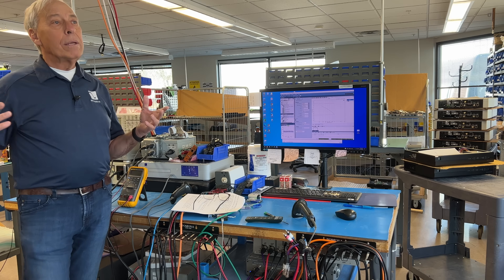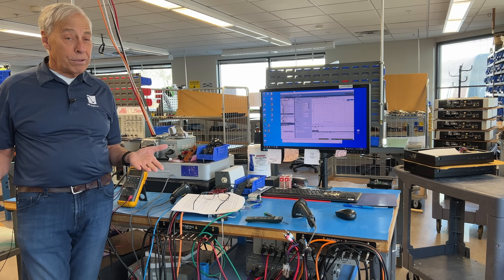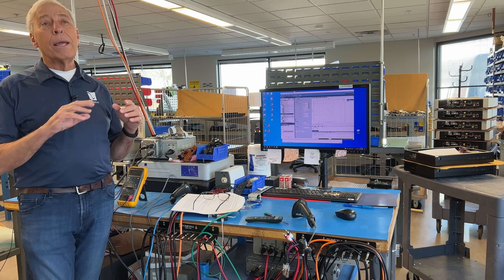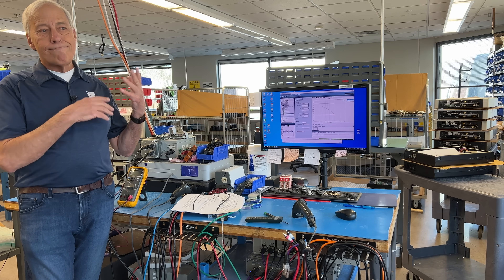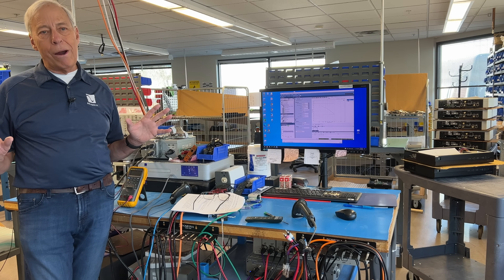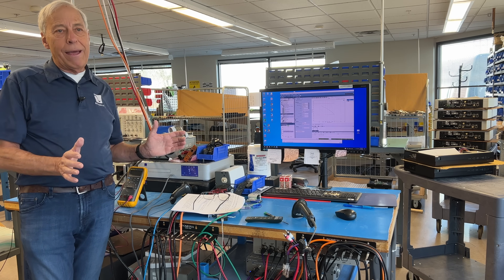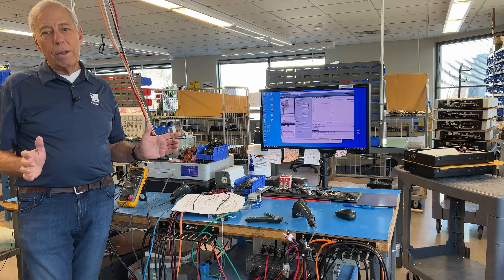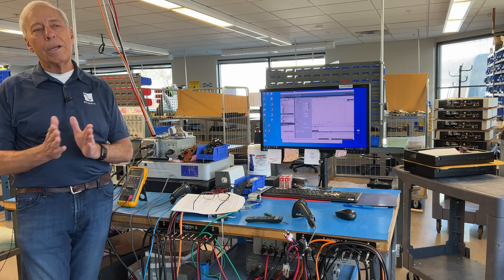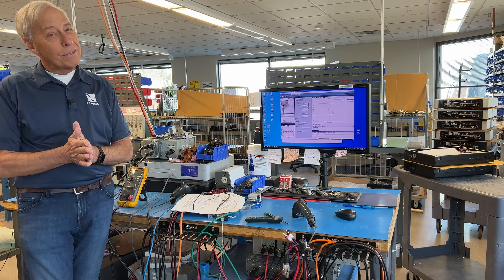And that's good. But is it a great-sounding amplifier? Well, that's only the beginning. You actually have to listen to the thing in order to tell if they did the rest of it right, because it could have too much feedback, it could be bright, it could have overshoot — all kinds of things with power amplifiers that have nothing to do with the power supply. Find out that fundamental issue first, before you go on to the next phase, which is the listening test. And please do listening tests, because amplifiers sound different. Yes, they do.